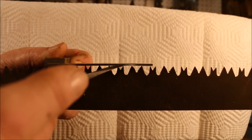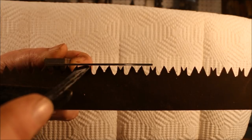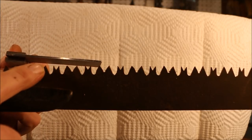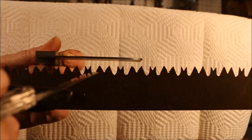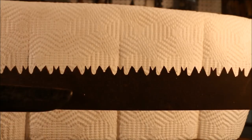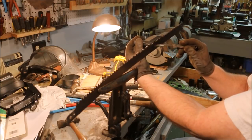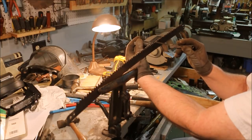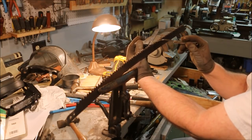If it doesn't fit, you don't have enough room. If that one fits but that one doesn't, you have to have it on both alternate bevel teeth — because it rides on top of that. That's my high raker; I need to file that one down. And I want to have about seven thousandths of clearance between the top of the rakers and the top of the alternate bevel teeth.